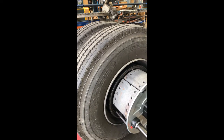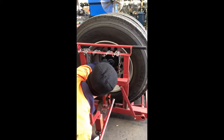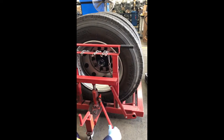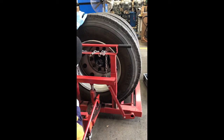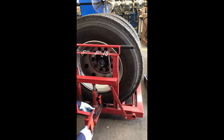Once the A&P spray has dried, slide the hub over the axle stub end and align the lug on the thrust washer with the keyway on the axle. Now push the hub inwards until the threads engage. Turn the axle nut in a clockwise direction. The axle nut will once again draw the complete hub on in one movement.